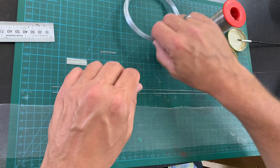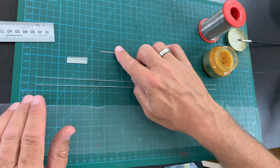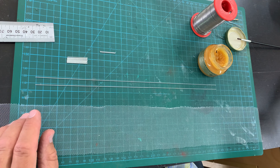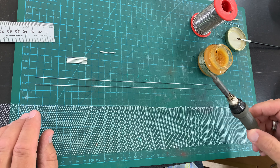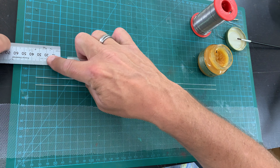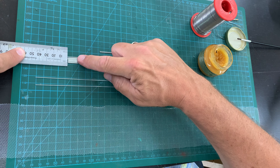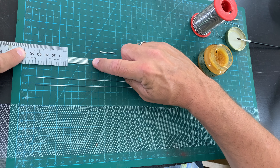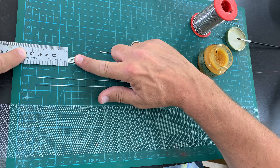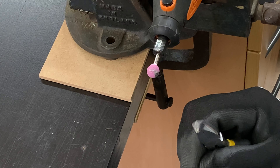The items I've now got are the two lengths required, the upright sections, and the two support sections, along with some mosquito netting, solder, flux, a small brush, and a soldering iron. The next thing is to check the overall lengths of each of the uprights — there's a slight discrepancy, probably no more than a millimeter, but getting rid of the burrs in a moment will bring them down to within a half millimeter tolerance, which is quite acceptable.